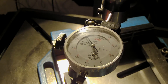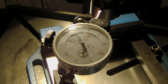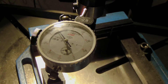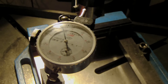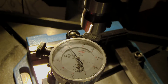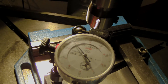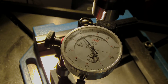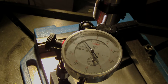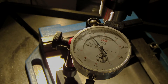I make it turn and if you look at it, we have about seven — and the unit is 0.01 millimeters — so roughly 0.07 millimeters of runout. That's really big.